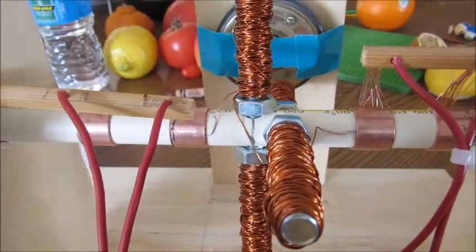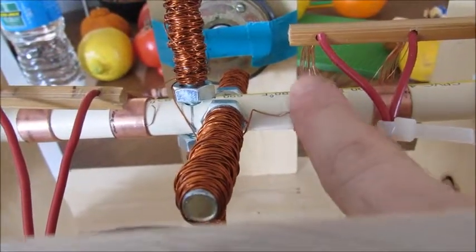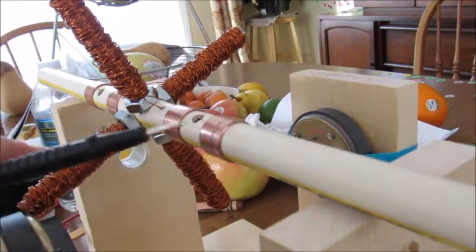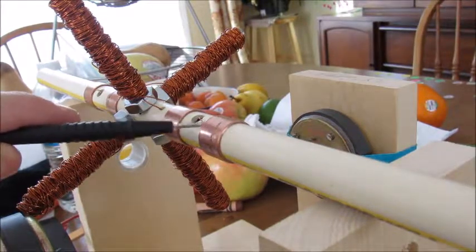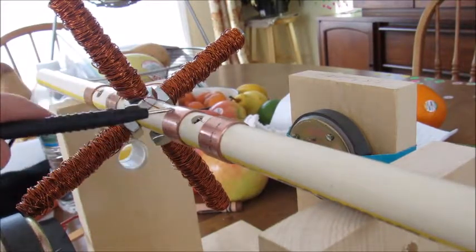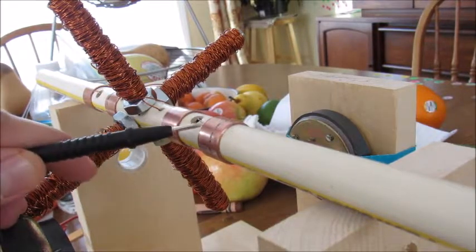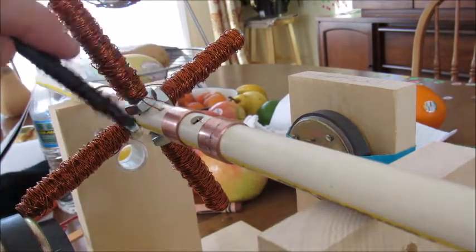I could see which part of the circuit I was dealing with. This coil right here — you can see this wire comes in and touches this slip ring. They slip around the brushes and turn with the PVC and the hand crank. I drilled a hole, pulled the wire through, made a hook, and connected it. The wire underneath actually holds the slip ring in place, and they spin freely when the brushes come down with nothing obstructing contact.